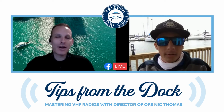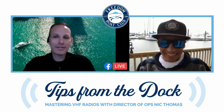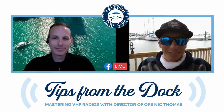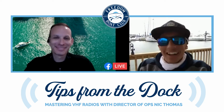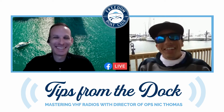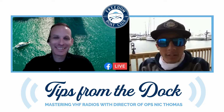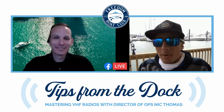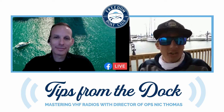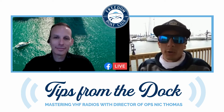So I know there's a saying all across the boating world, but certainly at Freedom Boat Club, that safety never takes a holiday. So what are your safety tips that you can provide our members when it comes to VHF radio emergency signals? Right. Safety first. I'm glad that's getting out everywhere now. There are actually three different levels of emergency when we're talking about VHF radio emergency signals. There's Securite, Pan-Pan, and Mayday. Securite is navigational safety advice, such as advisories, closures, storms or weather, or even maneuvers for commercial or military vessels.